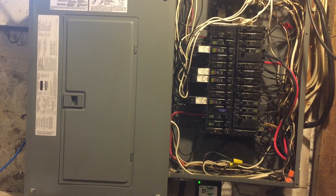Hello, this is RomeoCatComputers, and today I'll be revisiting the sub-panel that I installed in a previous video. I'll be righting a wrong and separating the ground-to-neutral that I had bonded incorrectly in this sub-panel. In sub-panels, you're not actually supposed to bond the ground-to-neutral.